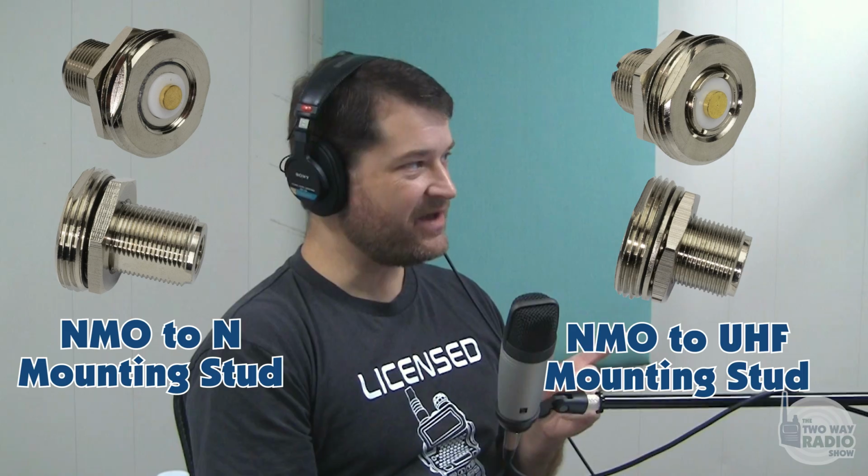Right. But what this allows you to do is, we have very high quality coax on our mounts in general, like our lip mount, hole mounts, all the mounts we've been talking about that include cable. We've upgraded the cable to CFD 200 style cable. You touched on it earlier, but we didn't really go in depth on why it is higher quality cable. That has a lot to do with the fact that it's less than half of the loss.